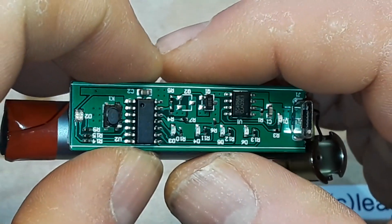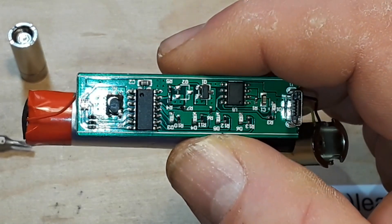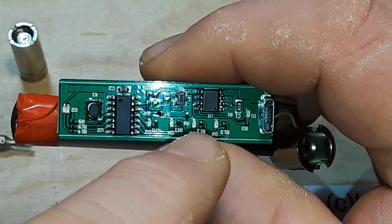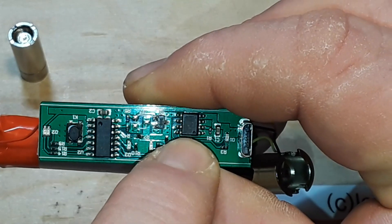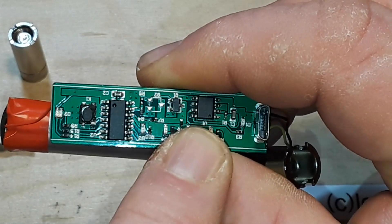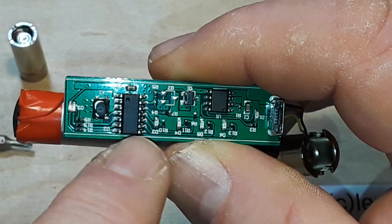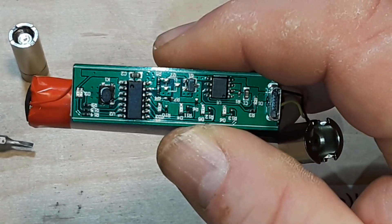So all in all, that's it — this is a pretty simple little device. I'm going to guess: battery control circuitry, charging monitor, over-discharge protection, then a microcontroller to control the on-time. This thing does have quite a few functions.